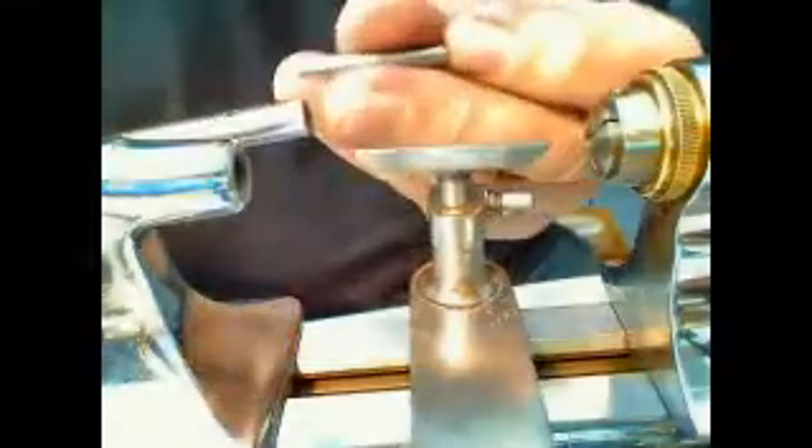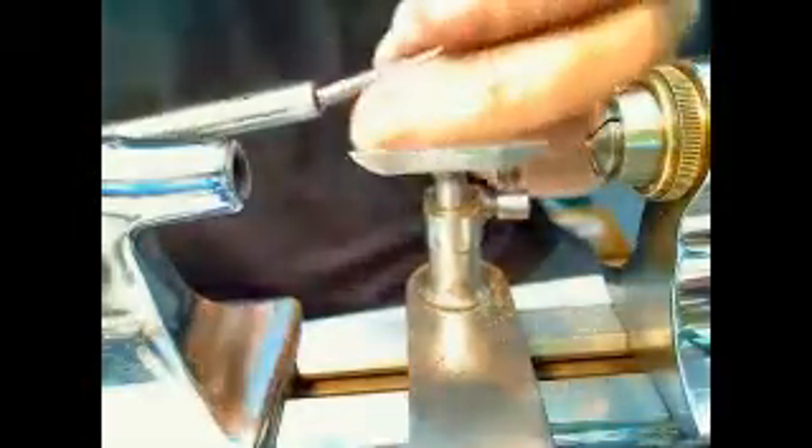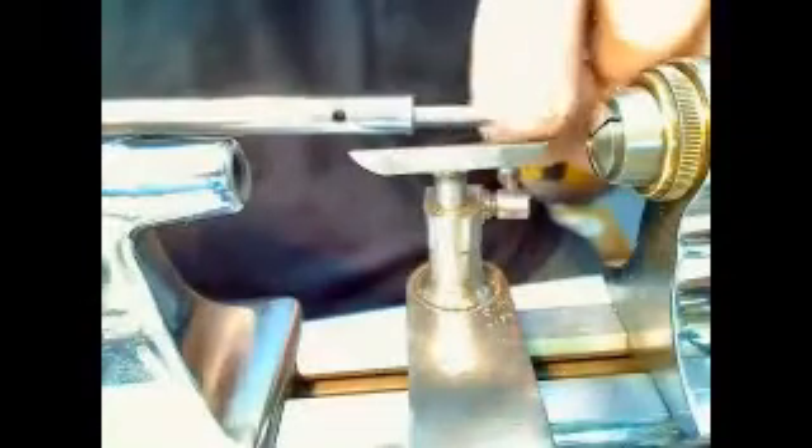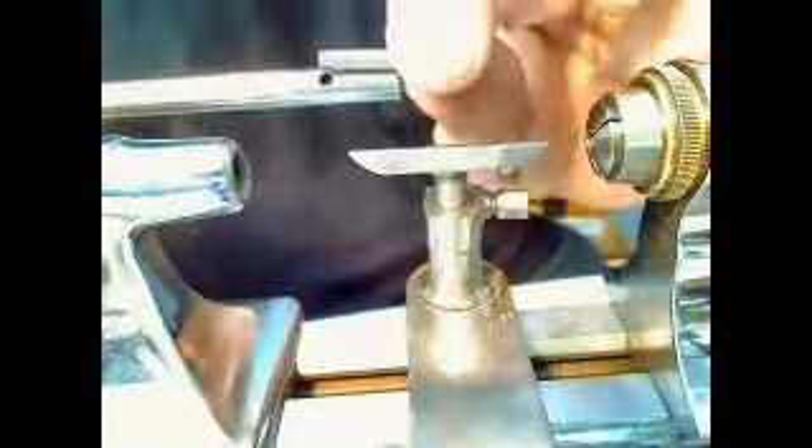I got a piece of steel, put it in the lathe right here, and then I tapered it down. The way you taper it down is you basically measure the end part of the hole first — you know the diameter of the end part, but you don't know the diameter inside the taper, inside the spindle. So what you have to do is actually build a part that goes less than halfway into the hole, because this is the knockout hole.